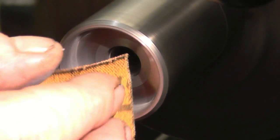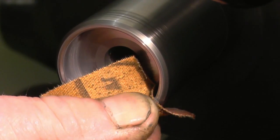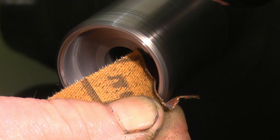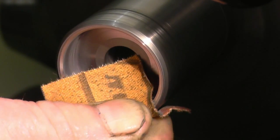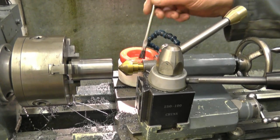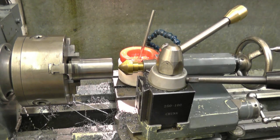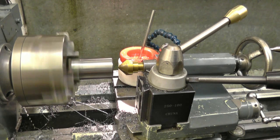Let's break that edge with a little bit of green abrasive. We've got a nice big countersink here — we'll use this just to break the edge on the bottom of the hole, just to break the edge of the reamed hole. Run the countersink nice and slow.